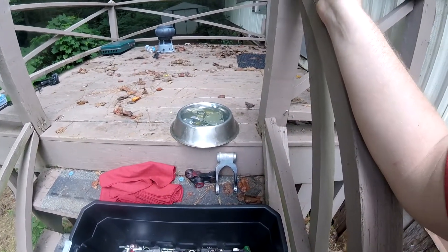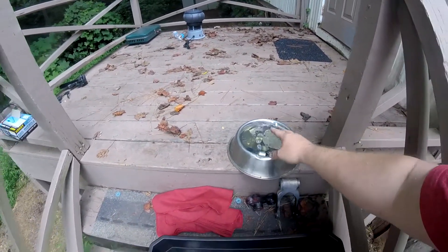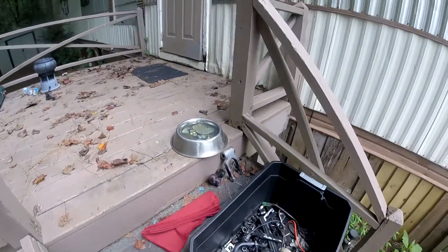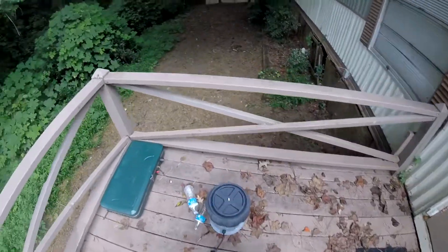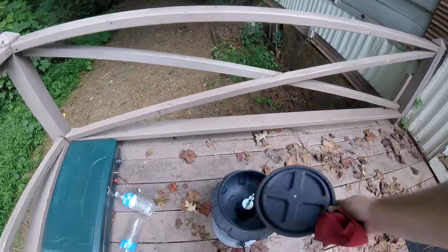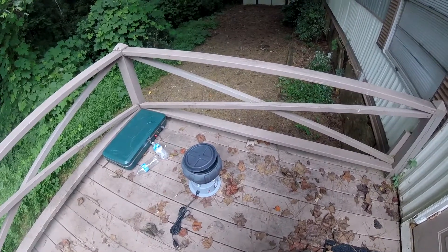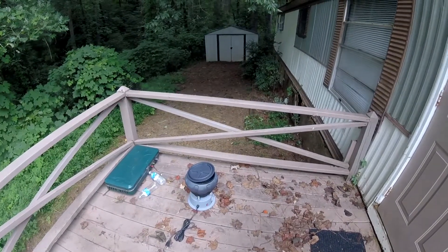Since I'm not going to eat out of his bowl, I figured I'd use it as a stainless steel wash tray. I've got some metal parts in there soaking in gasoline just to get the grease off. After I do that, all these parts are going to go in the tumbler. I bought one of those little five-pound tumbler kits at Harbor Freight — they're real cheap. You throw some media in there and it does a very similar job to bead blasting for finish removal, cleaning, and prepping, but you can plug it in, walk away, and let it run for a few hours.